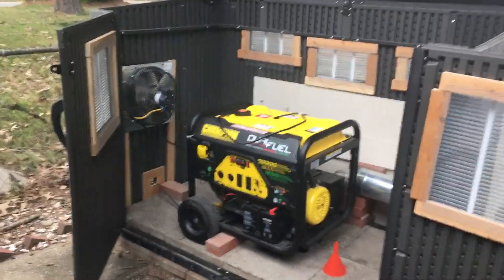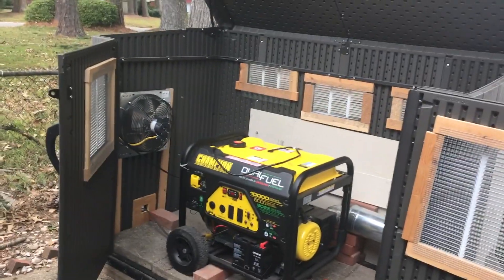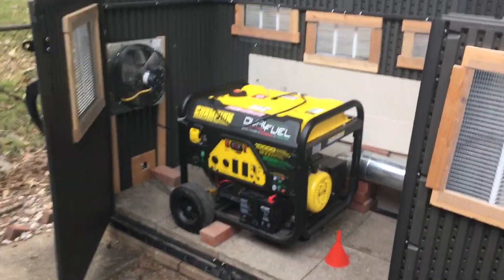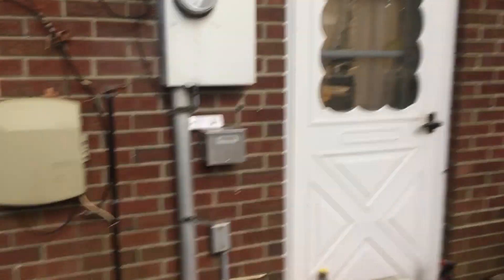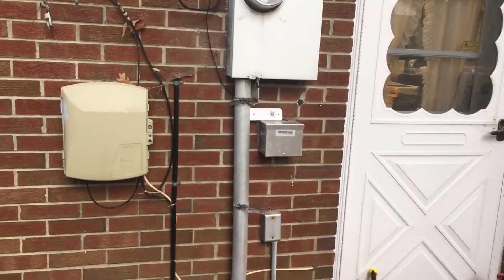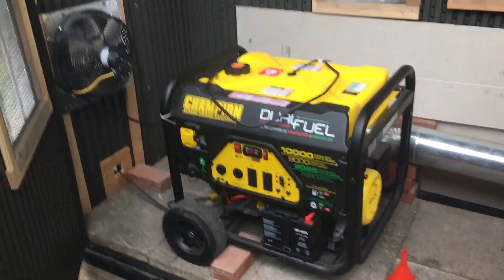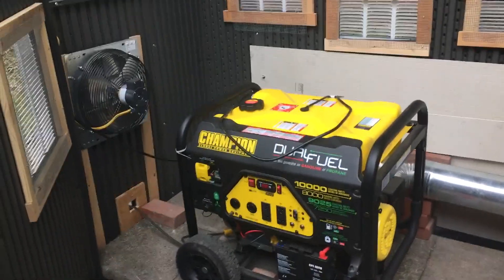After the rain events, I just go ahead and prop the doors open and let it sit, powering up the house. If it were to rain a little bit I can go ahead and close the lid. I've got a 30-amp cord running to the house and had an electrician upgrade my panel with an interlock generator switch so I can power everything — gives me 30 amps to the house. Can't run the air conditioner in the summertime since that's over 40 or 50 amps, but I have lots of fans and it's very convenient to have everything going in the house.